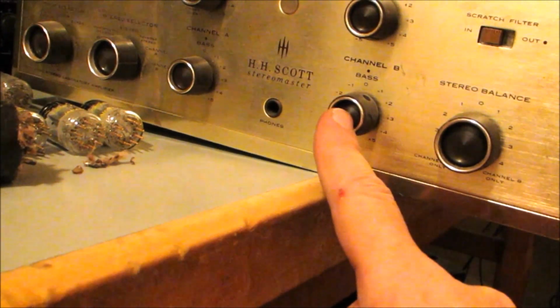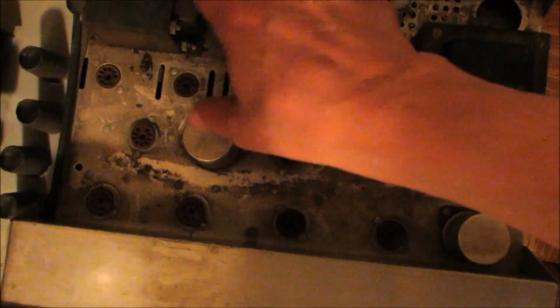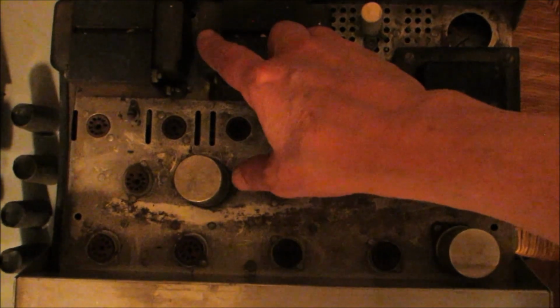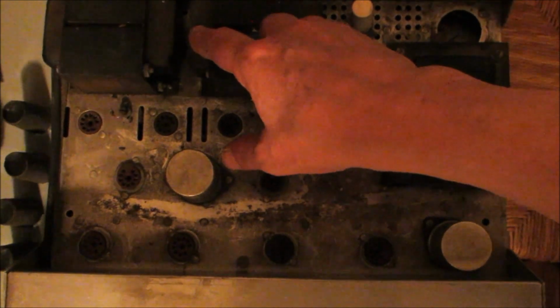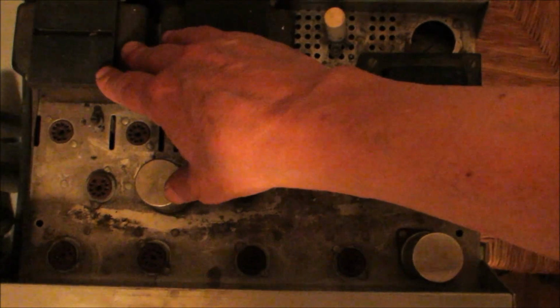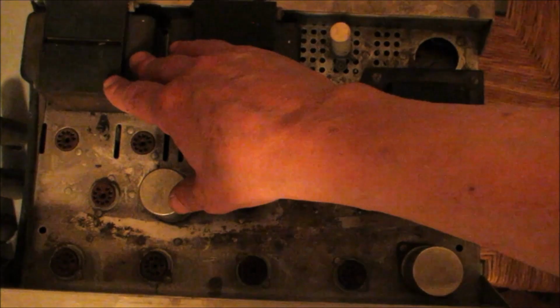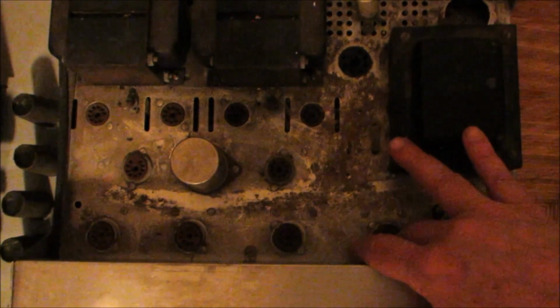It's going to get 2 monoblock amplifiers. So this thing, where it now has all this, will have 4 transformers. It'll have 2 power transformers and 2 output transformers. But it's not going to be a tube circuit, it's a solid state circuit. But because it has output transformers, it's going to use the connections on the back of this for the different output impedances. The only concern I have is that it doesn't have anything for 70 volt, but I'll figure out something on that score. And it'll have a preamplifier output as well when it's done.